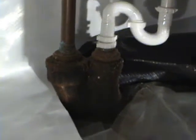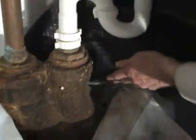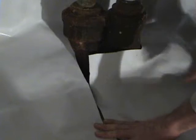All right, so here we've got the sewer coming up out of the ground, and then it falls right along the wall. So we're trimming the wall portion of it around the sewer, and it's simply just cut around it in a circle, and then lay the piece over top of it, and then you can trim it. Instead of trying to guess where the circle ends up, you just lay it back down, and you'll see where you're going to end up, and then it lays right back inside there, and you've got a seam that you tape up, and you seal it right up to the metal.